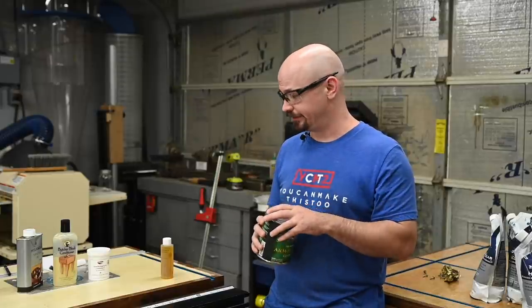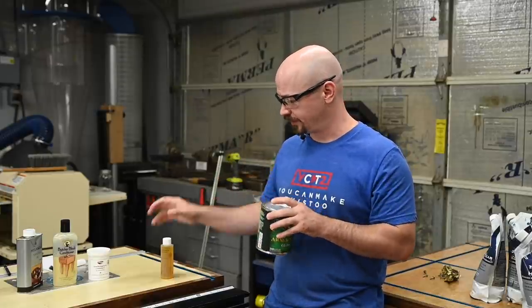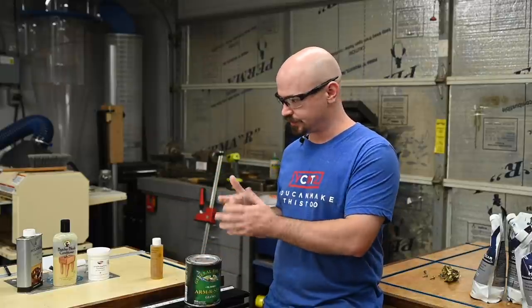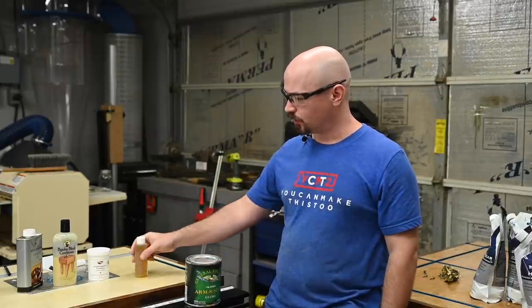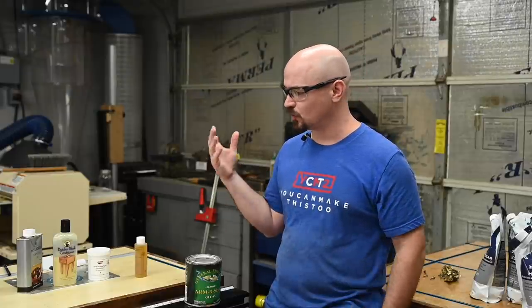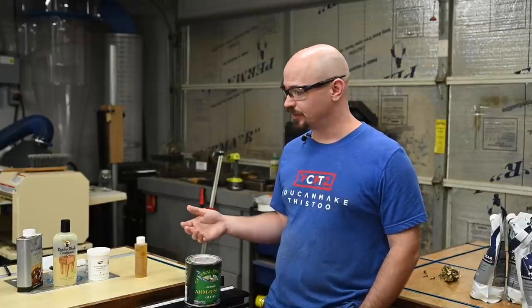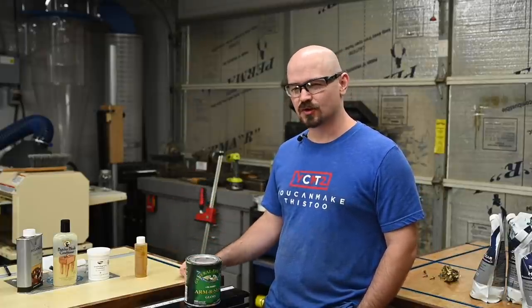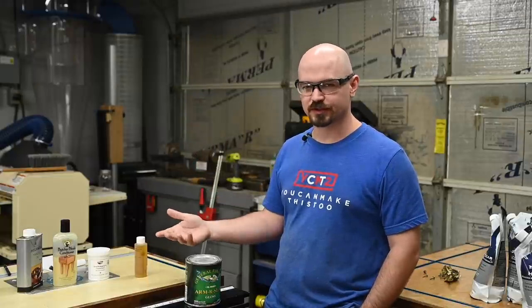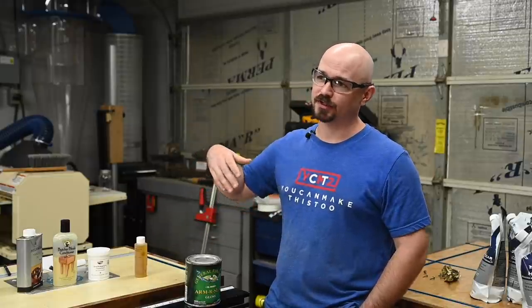And that be the finish. One advantage of that over some of the other finishes, all these more food grade things that are safe for human consumption, oils and whatnot, is even if they cure, they tend to wear out. They don't have the same type of water resistance and they just don't last as long. So they have to be reapplied. And most people these days just don't take care of their cutting boards and furniture the way that they need to be in order to keep their luster.